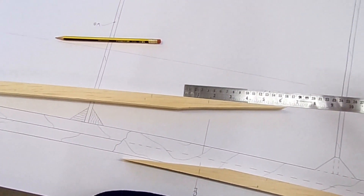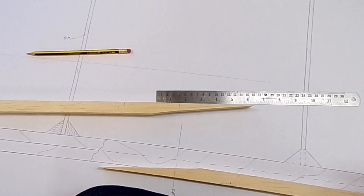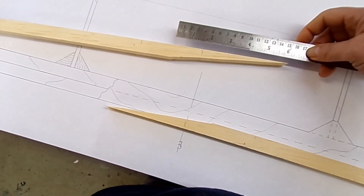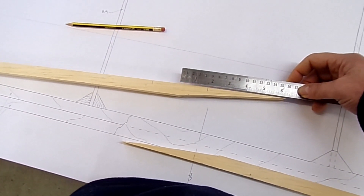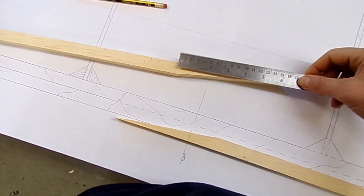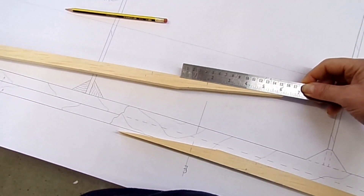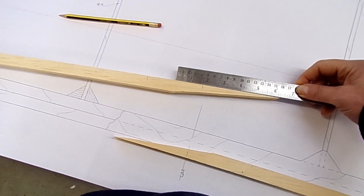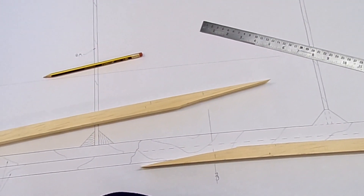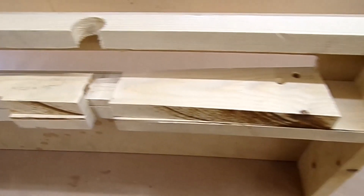This has been done by Fisher for keeping the price down for posting this particular kit, and also to practice the skills required for things like long scarf joints on the fuselage. For us in the UK, that's a one-in-ten to one-in-twelve taper. As this is three-quarters of an inch thick, we'd really be wanting at least a seven-and-a-half inch length of scarf — this one is six and a quarter. So we'll go ahead and I'll show you how I do my scarf tapers.